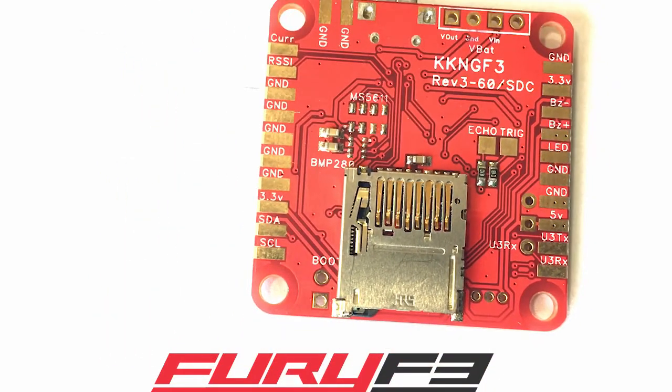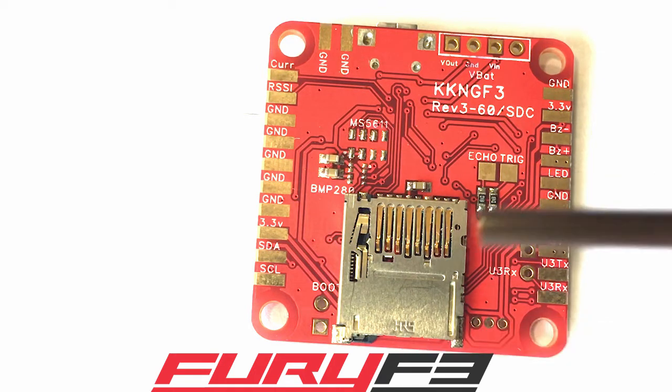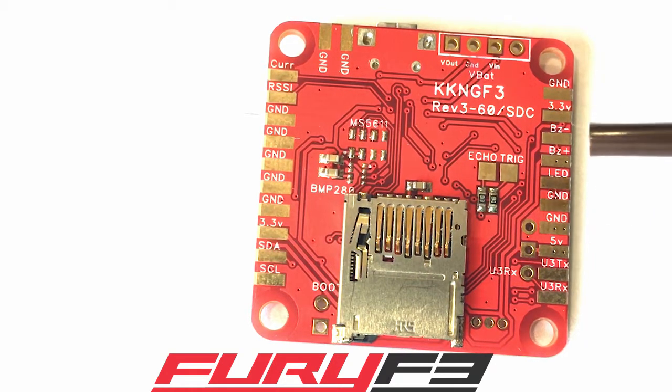Remember, each LED can pull up to 60 milliamps when lit, so you need to power your board somehow. Any of these five-volt pads is where you put your five volts from your power distribution board or your regulator. You can put five volt and ground power in there — five volts on the back side — anywhere you can put the power from the power distribution board and ground in.